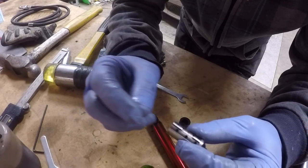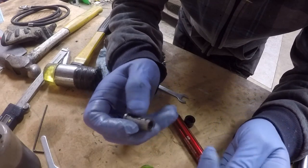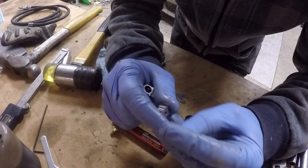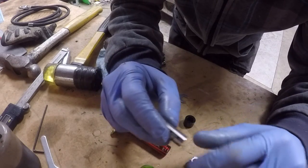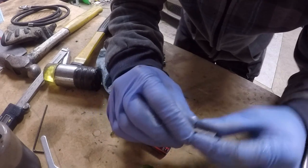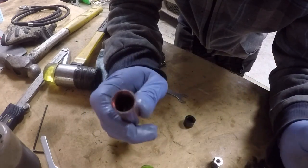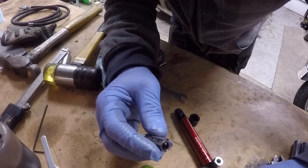Now this is very important. The position of the motor housing itself in relation to the case doesn't matter, and the position of this rear plug piece in relation to the case doesn't matter. But the position of these pieces in relation to one another has to be exactly right or the tool will not work properly. And that is why we have this little pin that locks everything together. So what I am going to try to do is put these three pieces together with the locator pin in the hole.